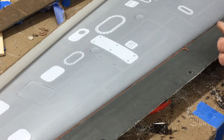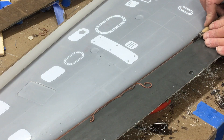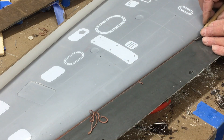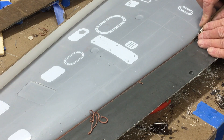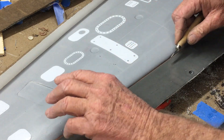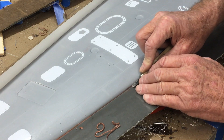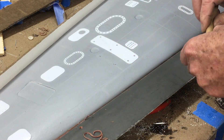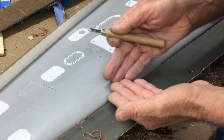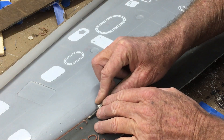Now it's just a matter of going along and removing the clay. I've got a very small chisel-type thing — not very sharp — and I'm just going to go gently down the seam and remove as much as I can. This is what's going to give you your parting line between the top and the bottom, so you don't want to gouge it. Being a leading edge, it's very easy to sand down — once you put the molds together, the glue or 'splooge' as I call it, to join the two halves, will squeeze out.